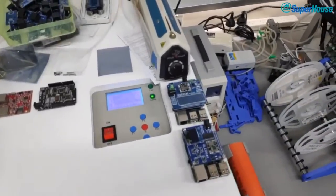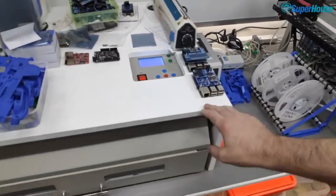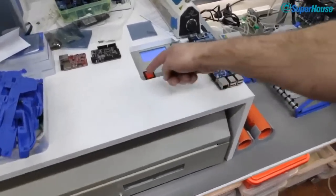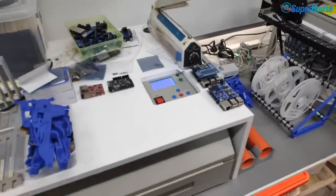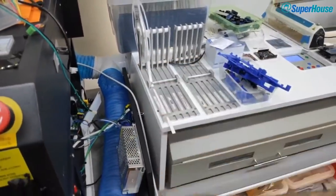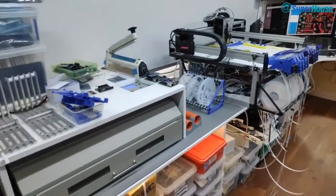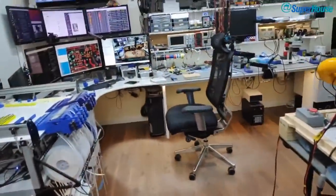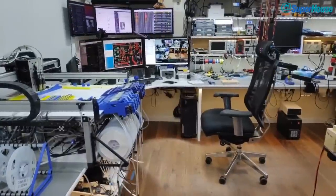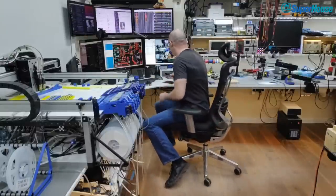And now, here is the little control for it. Now, this is the control panel for the reflow oven, and I've modified it to put it inside this wooden box. So I've basically built a box that goes over the top of the oven, and then I cut a hole in it to expose the control panel. And down here, you can see that there is an exhaust vent. There is a white T-piece down the back, comes down to this, and that blue exhaust goes down under the bench, and it runs all the way around the room. And there is an exhaust fan down that way that pulls the air out and it vents it outside the room. So while that is doing its thing, let's have a quick look at comments that I've missed.